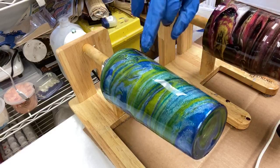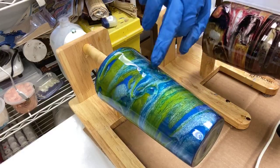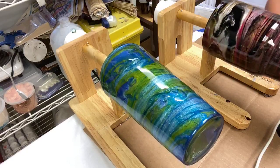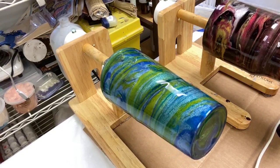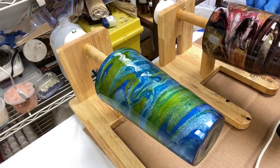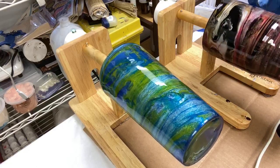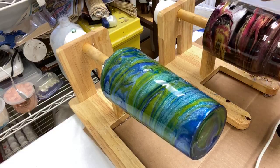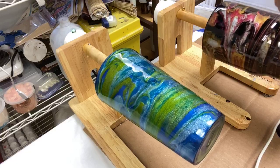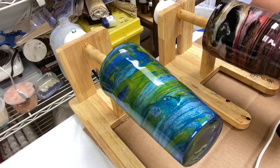And epoxy levels to approximately 1/8 of an inch thick. So pouring more on here, all it's going to do is just slide right off. So you don't want to do that. You want to just pour as much as is needed to get the effect that you want, and then hit it with a blowtorch. And I guarantee I probably poured more epoxy on some of this than on other things, because I knew all these colors needed to blend.